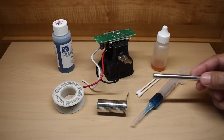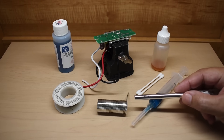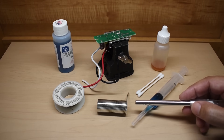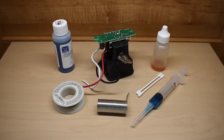A lot of people think that they're getting fumes off of the lead — in this case, this is lead-free silver bearing solder. But when you heat up the solder, even if it's lead, as long as you're not overheating that metal, it's not going to give off any fumes. All the fumes that you see when you're soldering are due to the rosin flux. In order to make 60-40 solder — 60% tin, 40% lead — start to fume, you would have to heat it way up in temperature, probably to around 1000 degrees Fahrenheit, or roughly 537 degrees Celsius.